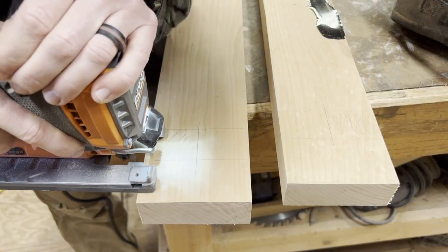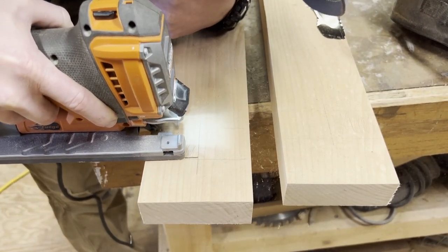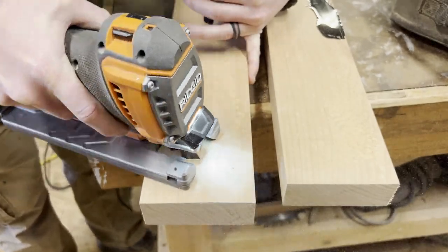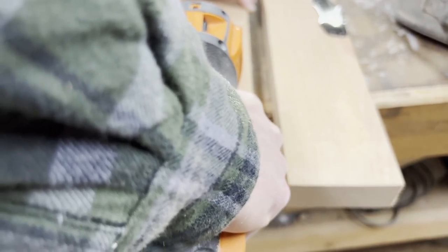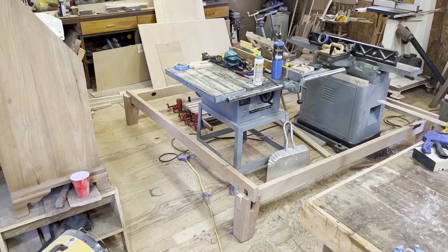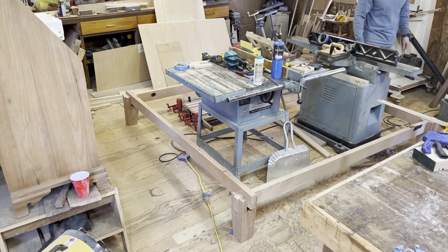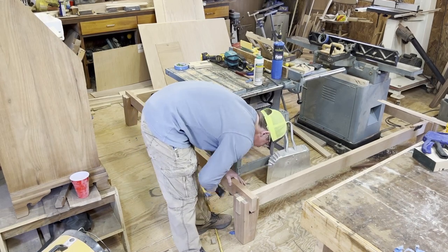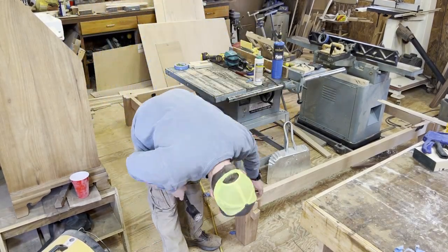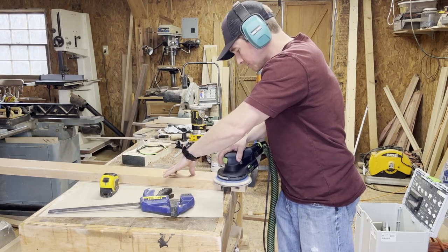I want this channel to also show mistakes, because none of us are perfect. My first mistake was with the jigsaw. I believe a good jigsaw is comfortable in your hand and works well, but the problem with all jigsaws is that the blade will sometimes flex on the bottom side. My second mistake was the first dry fit — if you have to use a mallet to make your joints fit, it's never good. You can see that the bottom right corner broke. I had to go back, glue it up, clamp it, and sand the glue down — and really you can't see the crease.